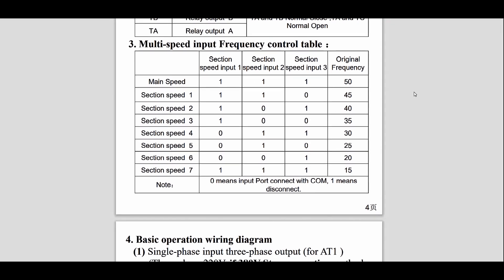If X3 through X1 are configured to select the stored profile, this table shows how that's done. Zero means grounded — so if I grounded X2, we would have stored profile 2. You can see a mistake in the table: speed section 7 must be 0, 0, 0, 0, 1, 1, 1.